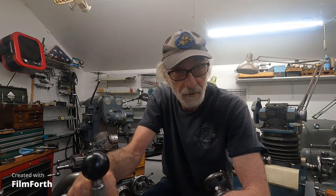And cutting the aluminum shows that the lathe centers are out by five thousandths. So I'll adjust it. I found a little smoother gear for that little Grizzly to run in. That little Grizzly is not a bad little machine — it's pretty tight and everything. But I thought that device for checking the centers, it does not work. I tend to just put metal in the machine and start cutting and find the faults, then do what I can to fix them. It got that machine straightened out real quick — just machining a piece of aluminum.